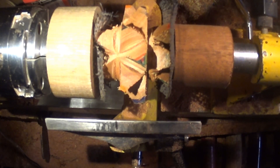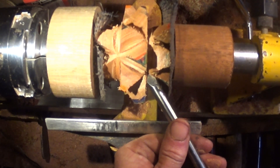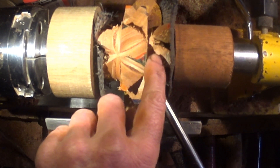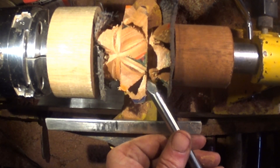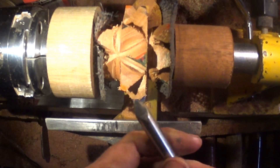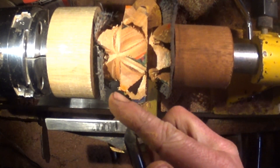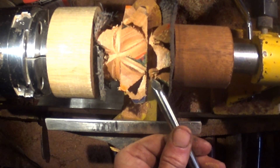To get the transitions right, I come down the face of the cut I'm currently making — a right angle cut with my point tool. The included angle in there is 61 degrees and this is 60, so that makes a really nice job.